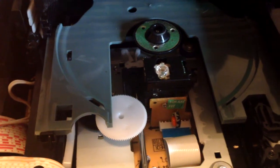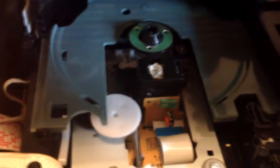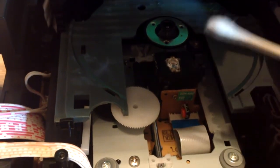What we're concerned about is getting to this CD player, and now that I got all that out of the way we should be able to get in here. That CD was laying up here on top of the drive mechanism. There's the optical pickup - I'm going to put a tiny drop of Windex on here, not much.